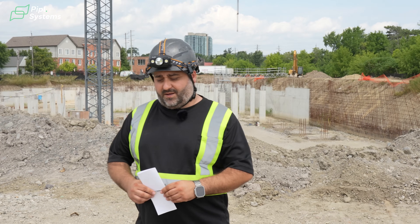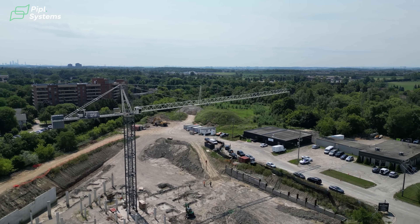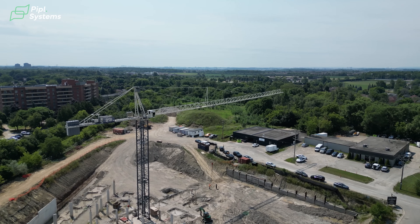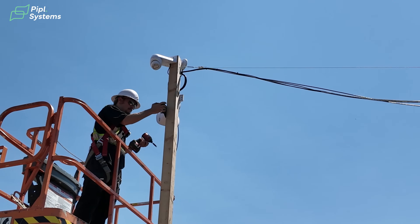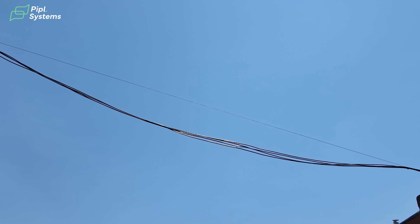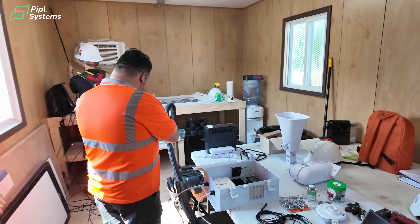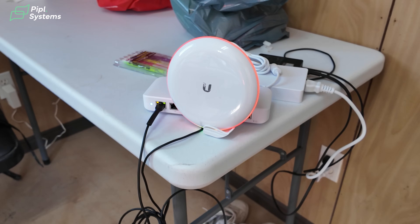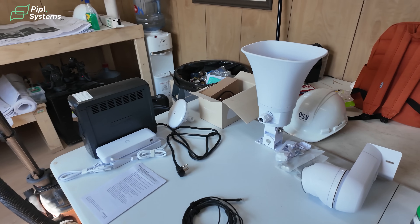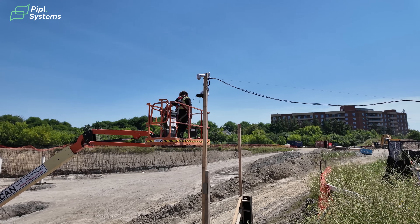For this site there's a lot of complex stuff going on. We can't have wires in some locations on the floor because there are cars, trucks, and heavy equipment moving. So we had to go with a wireless solution as well — it's a kind of hybrid system: wired, wireless, and wired back again. Ubiquiti was the brand we chose to implement here because their huge ecosystem has everything we need, from networks to wireless to cameras, horns, and even integration with webhooks so we can use third-party equipment, which they need for verification with the monitoring station.